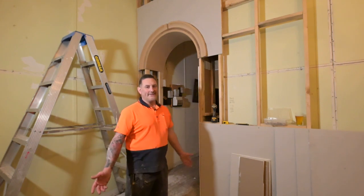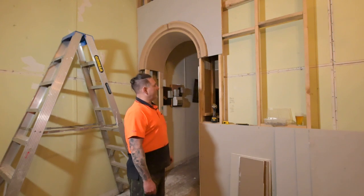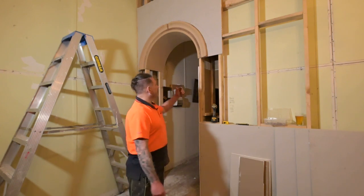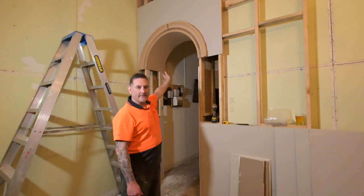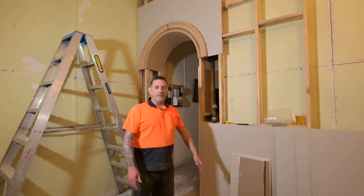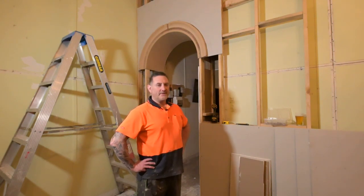But it won't matter at the end of the day. One thing that I've always been good at is working out how to get myself out of the poo. So, you know, you make a mistake. It's not how many mistakes you make, it's how you get out of the mistakes. I'm going to put a piece up there, I'll tape that, and then I'll do my corner taping, and that's got to be all plastered up anyway, so that's not going to matter at all. It'll all be fine, but it's annoying. I don't like messing up. And the thing with messing up is it then just takes longer to do the job.